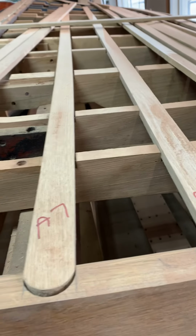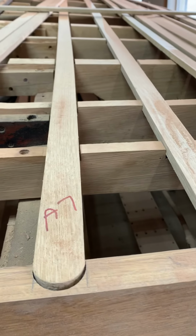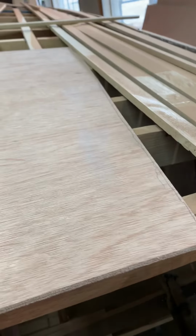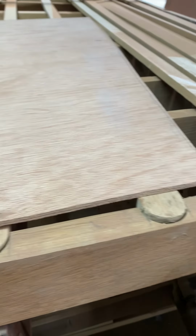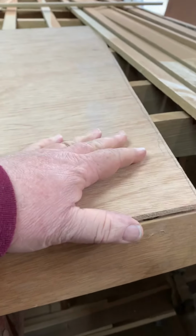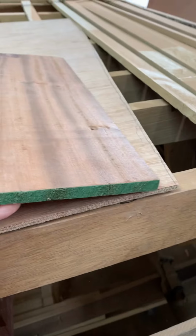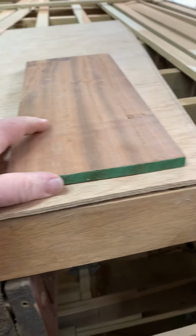alternative. With Chris Craft, because we don't have the battens, they built their bottoms with two layers. They call them double planked. Initially they were a very light plank, in the early years. And then later on, they started using plank over plywood. So they'd have a plywood layer on the bottom, and then they would put the planks on top of the plywood layer. And the planks may or may not line up.